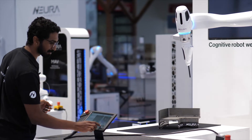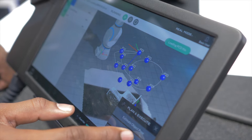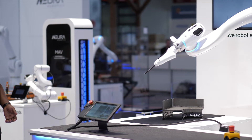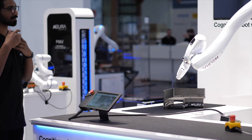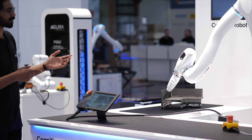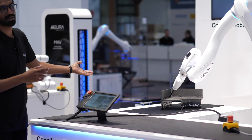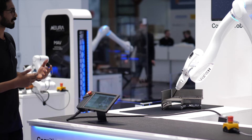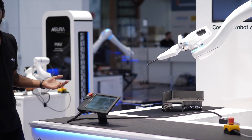It is showing me and asking, is this okay? Well, it looks good. Please execute the weld without having to teach again. Let's see it weld now. The welding parameters she has decided for herself based on her previous input. You should see her weld. You could additionally give more parameters — obviously the welding angle, welding speed, turning it on and off. There are things we want to improve. And of course she's just done welding without me having to teach her again.